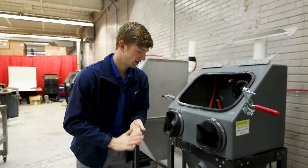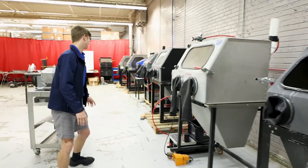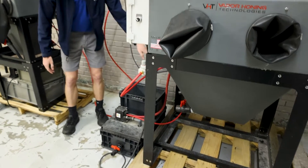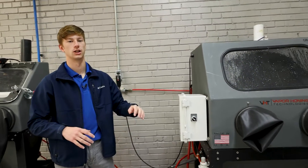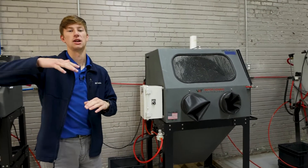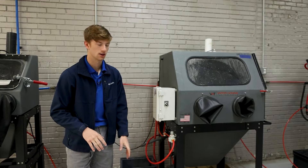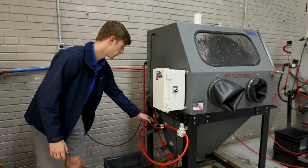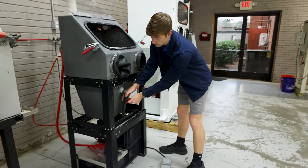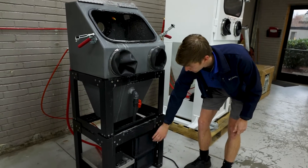Regarding the basins, on the 700 here they sit underneath, but on an 800 style cabinet it actually sits beside the machine. As you're blasting, it's going to fill up with water on the inside of the cabinet — whether you're rinsing the part off or the window rinse is spraying — you're going to be incrementally adding water into your hopper on the inside. When you finish blasting you need to allow the abrasive to settle in the hopper. On the 800 cabinet it's going to drain automatically, but on the 700 you can see it has a manual drain valve that's going to allow the machine to equalize with your basins.